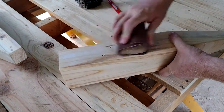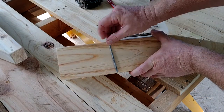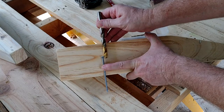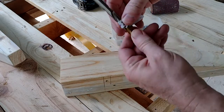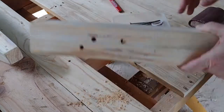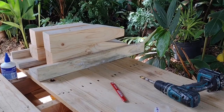Sand off any rough bits on the other side. I'm planning to join the legs with these 100-millimeter screws — you can see they're too short to go all the way through, so we need to sink them in a fair bit by drilling a hole that the head will go through. I think that's an eight-millimeter drill bit, and I want it to go about halfway into the leg, so I'm marking it with a piece of tape so I can be sure it goes the right distance in. There are all the parts we need to make the ends — they're ready to assemble, and we'll do that in the next video. Thanks for watching.